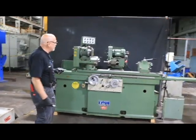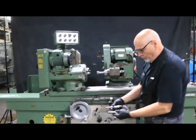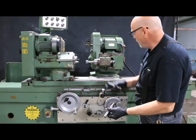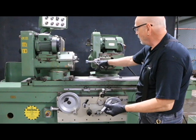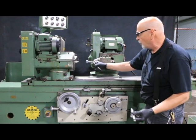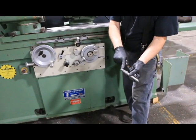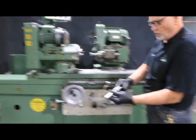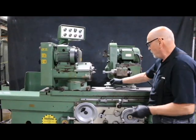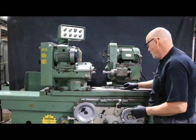I just wanted to come back and say a couple of other things about this spindle. We do have a couple of additional ones that go with this. There's a taper on here that fits inside there, and on the back is a threaded rod with a nut that goes all the way through and screws into the back - I think it's a quarter-twenty or five-sixteenths thread, or it may be some British standard thread. We do have a couple of extra ones and you can obviously make your own if you needed to.